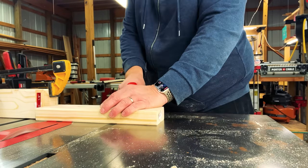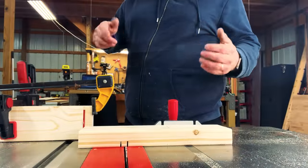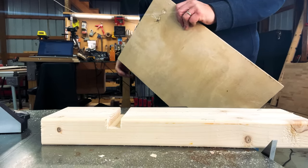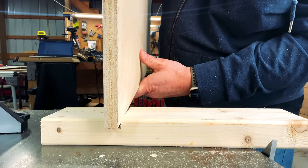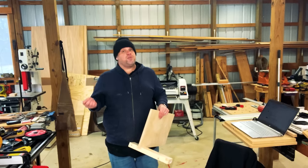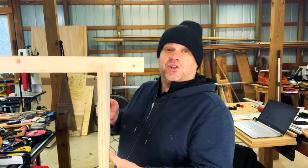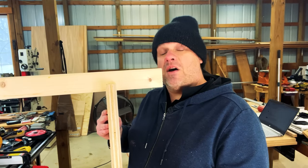Push the flush edge all the way to the table saw fence, then use the other side as a reference to cut out our dado. I've clamped both pieces of wood together and clamped it to my table saw fence. I'm using an eighth inch kerf blade, so I'll take an eighth inch setup block and attach it with double-sided tape to the inside board to account for the kerf. Then make the first cut referencing the longer board and the second cut using the shorter board with the setup block, then hog out the middle. It's a perfect fit.